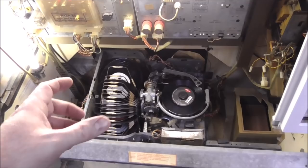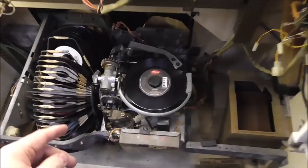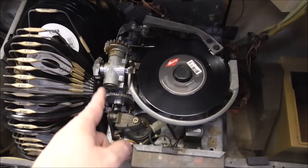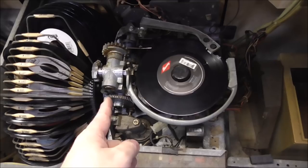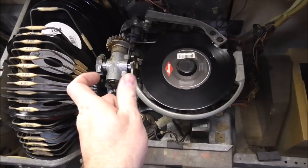But watch what happens when it ends. I'm going to end the record, and when I do, the way that it hangs it up is it does everything in reverse. So you'll see the gear start turning. But the problem that we've got is that it's not completely clean, so it's still sticking a little bit. So when the gear turns, it should first push the piston out, right, so that it grabs the record. That's the very first thing it should do.